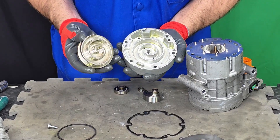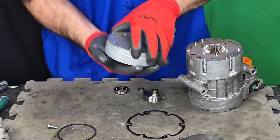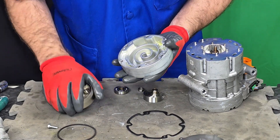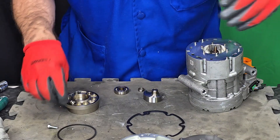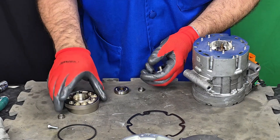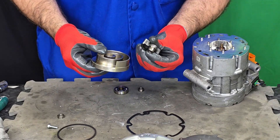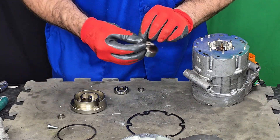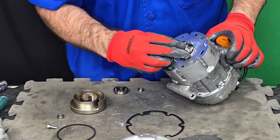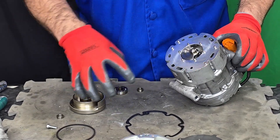What I really want to show you is: does this scroll go in every random position, or does it go in one particular position? The answer is it only goes in one single position. The first thing is we have to place in here the counterweight, because the scroll piston moves in an eccentric rotation. That creates a lot of vibration, and of course that needs a compensation of weight, which is exactly what this counterweight does — and it only goes in one single position. This is the movement that allows the eccentric rotation.